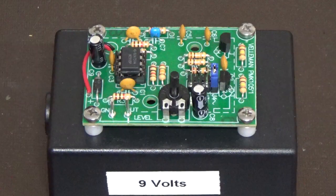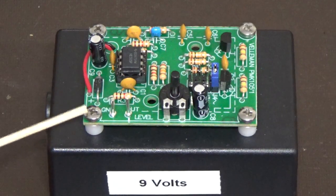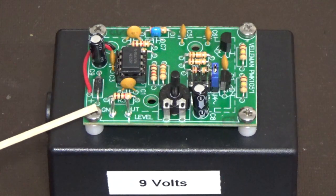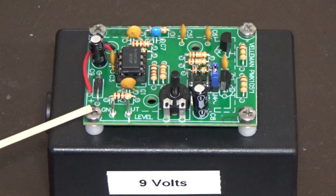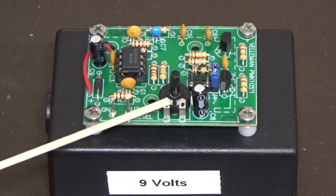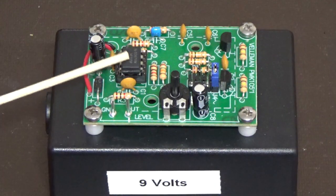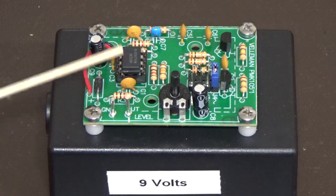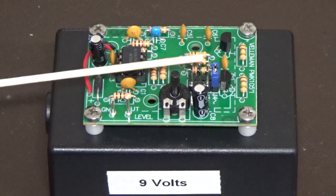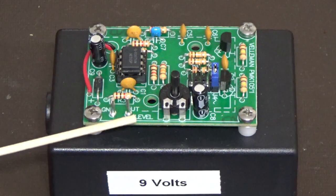So the first one we're going to have a look at is the Velleman, which is the smaller of the three. Now they're all function generators, but this particular one is more classed as a signal generator, but it does have 4 different outputs. You do have amplitude adjustment to some degree, but it's only fixed frequency, and it's run off a 555 timer, and frequency selection is through these pins here, and the output is right there.